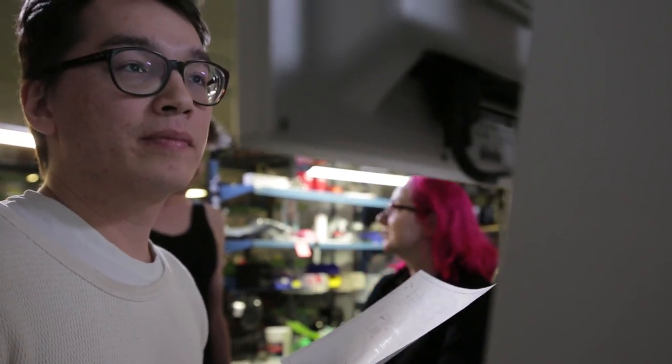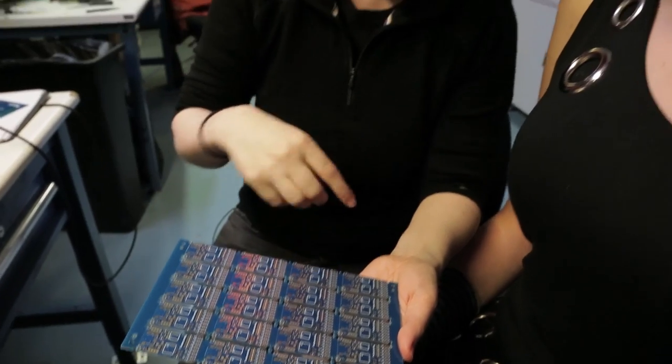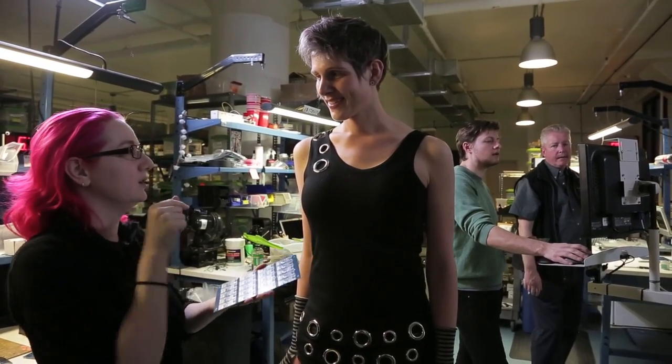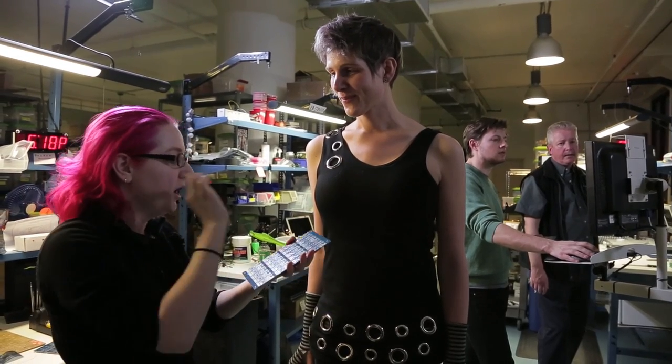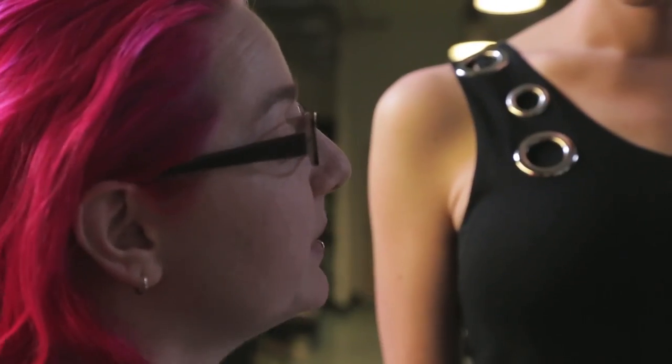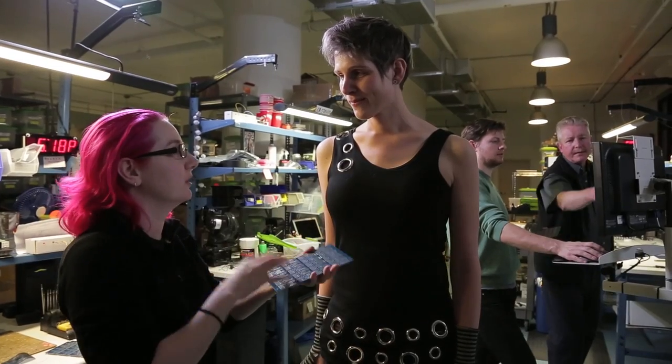So we took your design, the FadeCandy board, and we panelized it — we copy-and-pasted it five times by four times, so it's 20 PCBs per sheet. This means we pick and place 20 at a time. The pick and place is really smart — it calculates how fast it can pick up six components at a time and place them. It doesn't do it the way a human would, going all the resistors, all the USBs, all the capacitors in order. It does them in whatever order is fastest.